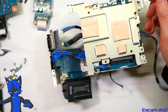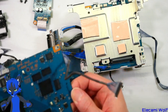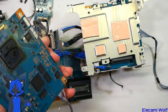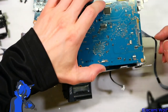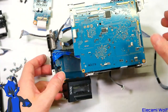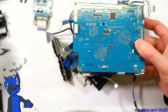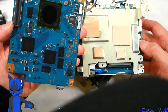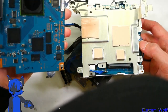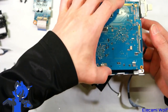So the next steps: I guess I'll try reseating all the connectors on this board and maybe cleaning it a bit. Then I'll try putting it back together. I'm going to try cleaning these thermal pads off because they're full of dust and stuff — isopropyl alcohol and wipe them down, clean the connectors, reseat them. I'll just lay the stuff together so that I've got some chance of working out where it all goes back.